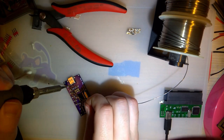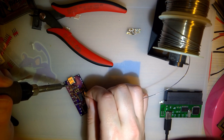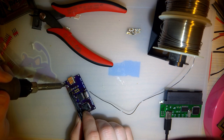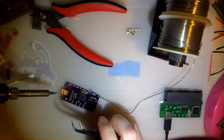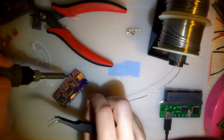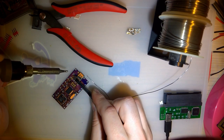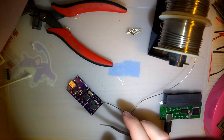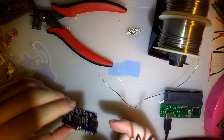Because the purpose of safety devices, in this case, is to prevent this thing from blowing out the USB port on your computer. I don't know about you guys, but I'd rather be out a shitty little reader, no offense, $10 worth of parts, as opposed to blowing out the motherboard on my $800 laptop. Not that my $800 laptop is still worth $800. But even then, that's a resettable fuse, so as soon as you remove power, it should reset.